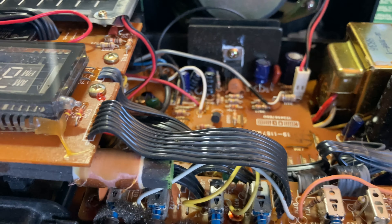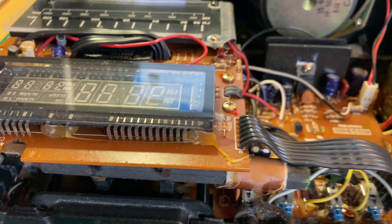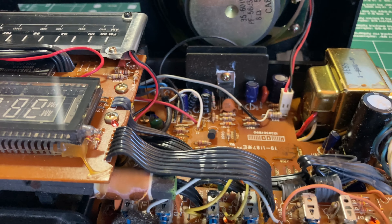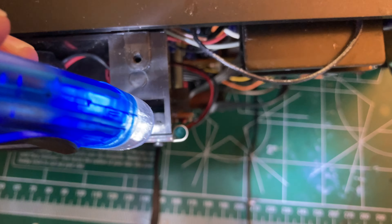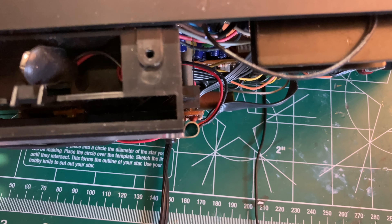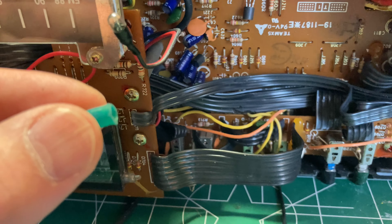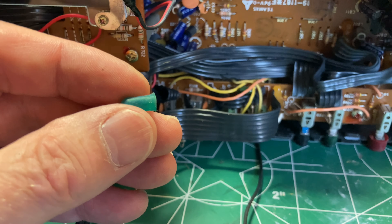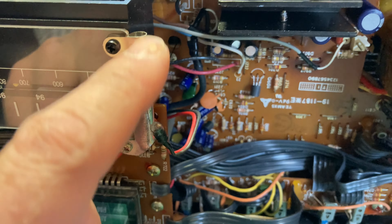I'll have a quick look to see if there's a bulb that's easy to replace. If not, I'll probably just glue that back and put it together. The foam around the buttons has deteriorated as it tends to, but it's pretty clean inside — nothing wrong with it. It just looks like it's been dropped. There's a big chunky transformer and a very large speaker magnet. That looks like the output transistors — just one for the amplifier. There's the dial light down there. I'll have to figure out how to get it out and then see if I can get a new lamp for it.